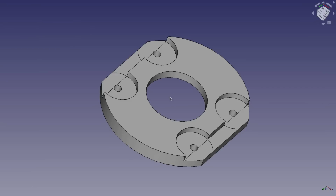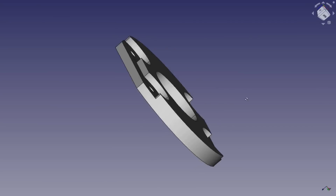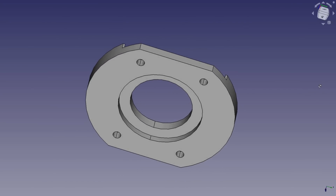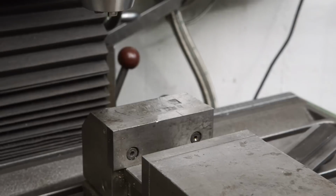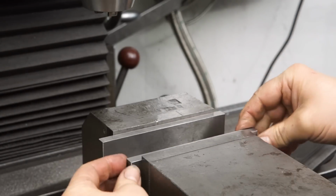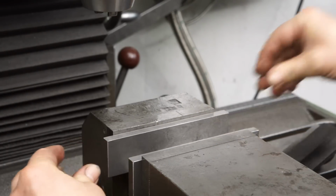I came up with a more stable design with a plate matching the gap between the bottom of the compound slide and the bottom disc. Thus, most of the slide should rest on the plate. The bottom of the cross slide is just an unmachined casting, which is not suitable as a bearing surface.